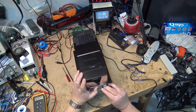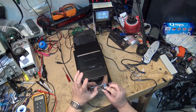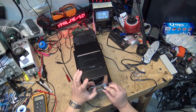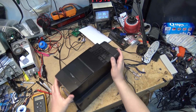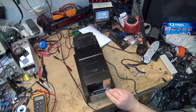Okay, it only goes to 87.9, and mine I think is on 87.5, so it's not going to tune it in. But anyway, we know that the radio works. How about the AM band? Should be able to tune in my AM test transmitter on 1440. I guess if I hold my antenna or hold my hand near the antenna terminal, it'll work. Yep, that works. Okay, so we know that that part works.